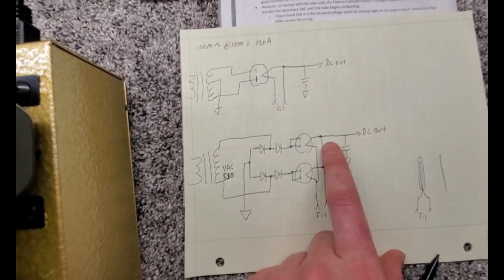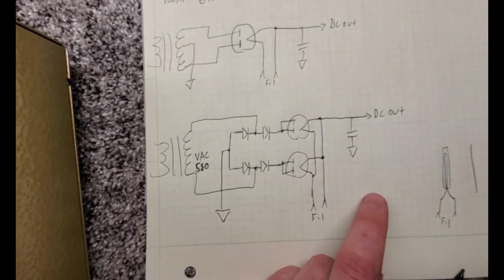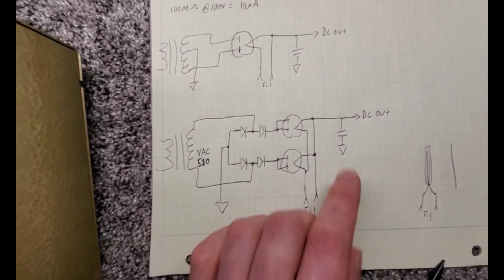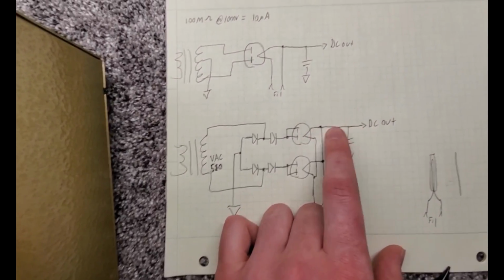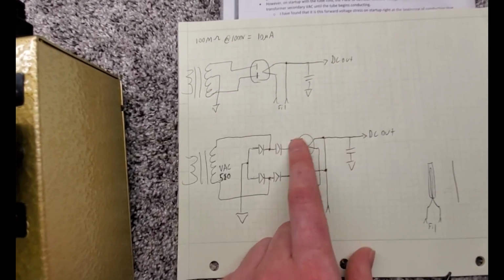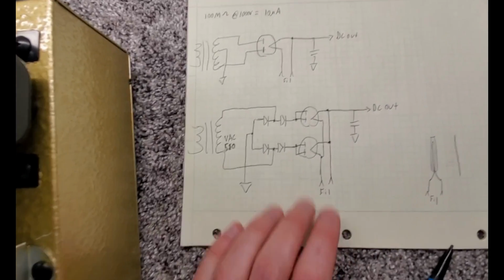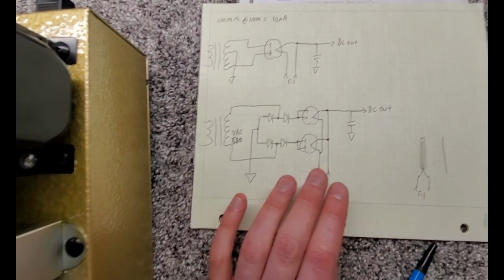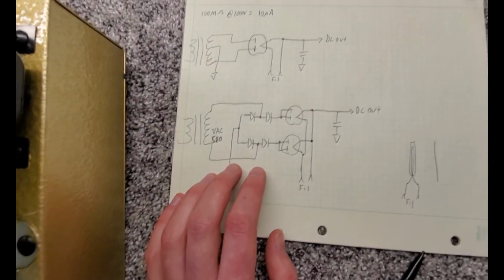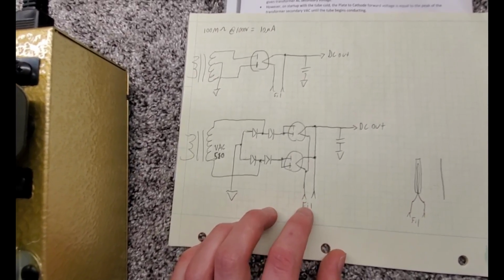It has nothing to do with the reverse or peak inverse voltage you often see talked about online or in data sheets. It has nothing to do with them blocking reverse voltage, because again, we're balancing it, and we're still within spec even if we didn't have a diode, although it would be marginal. You definitely want the diode in there. But anyway, that's not the issue. It's the forward blocking that the tube has to do when it's cold as the filament warms up.